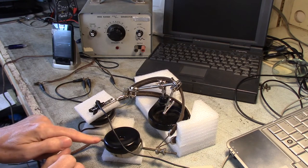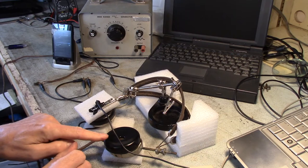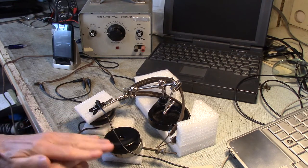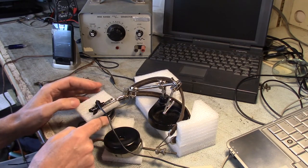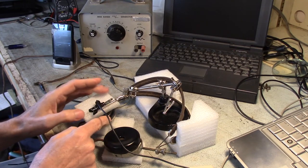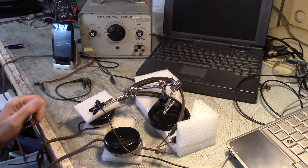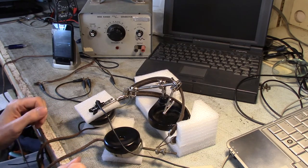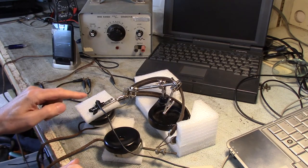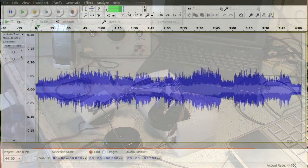Initially, I was thinking that what I call the right-hand side, which has the extra tape, was weaker, but it had some iron filings in there, and I took those iron filings out, and the strength of the magnet was quite a bit stronger, and the audio seems to me to be stronger than this side. So it could be that the magnets on this side are weaker. Maybe there are some iron filings I didn't see on that side that I could clean up. There might be some differences in the diaphragms. Maybe I'll try those and various other things, but let me give this same thing a try again, where I'll play this signal and try it again here.